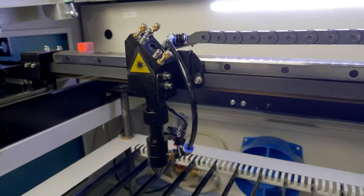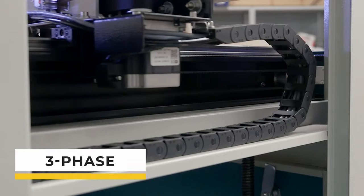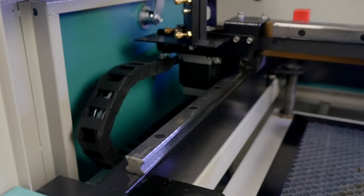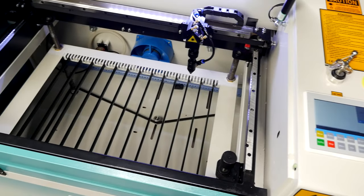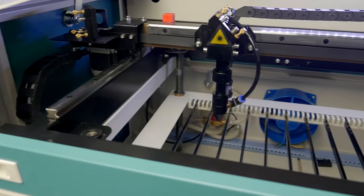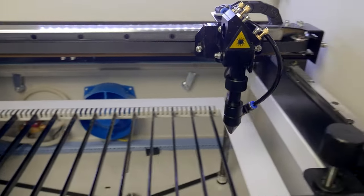The Watson 0503 is equipped with 3-phase stepper motors. A 3-phase stepper, in addition to its highest reliability, has a smaller pitch size, which increases the engraving quality when producing and cutting small items. This is relevant when cutting fabric, leather, etc.